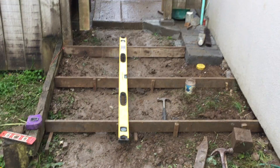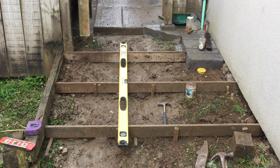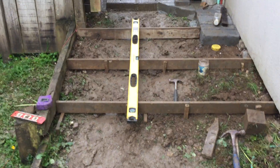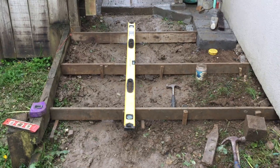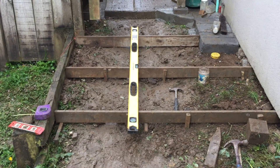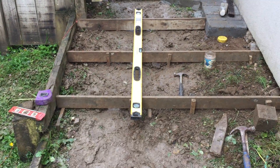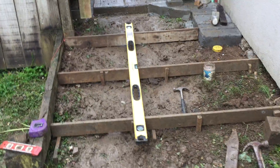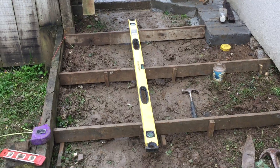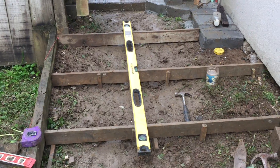Hi, good afternoon friends. Today is Thursday 15th of October 2020 and the time is 5:55 PM. Despite the rain, I was able to do the shutterwork for the bottom section of this round concrete footpath. The thickness of this slab or concrete footpath varies from 70mm to 65mm.